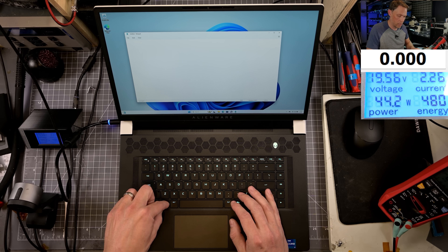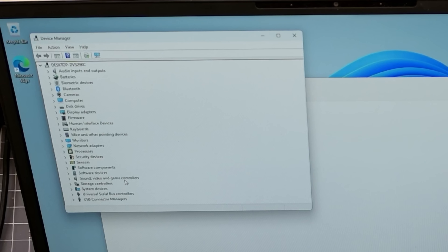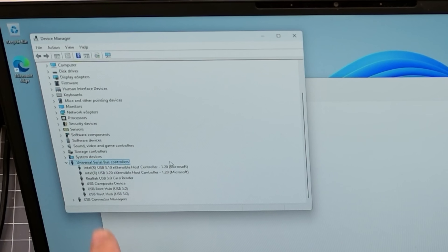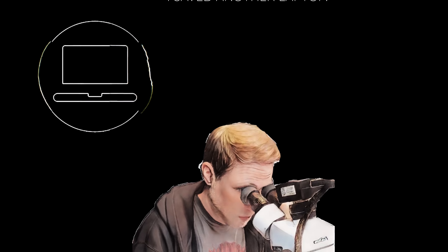This keyboard acts as a USB device because it has to interface with the computer in a way where you can control the color of all the keys. If this was just a regular keyboard, you would never have this issue — it's only these high-end gaming laptops. Let's check Device Manager, and you can see we no longer have that device erroring out — we have all our devices showing correctly. This laptop is all fixed. I can get it back to my customer. Thanks for watching — I saved another laptop.